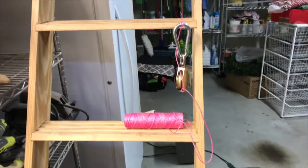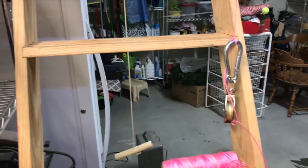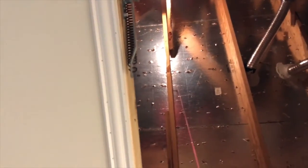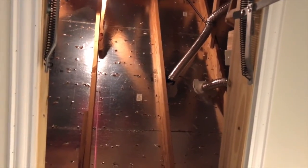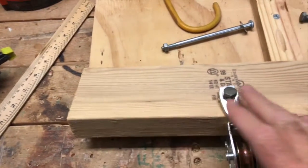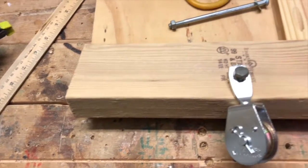The first step is to find exactly where I want to hang my cross rafter. I put a weight on a string that goes right up into the attic so I can see exactly where I want that to be, then I come straight up from that and put the board between the two rafters. I've measured about six inches from the end so I know where my first pulley will be, and I've gone ahead and bolted it on the board.